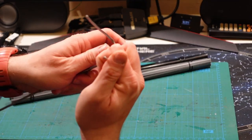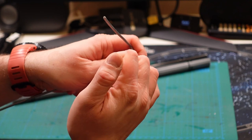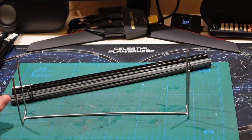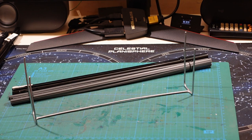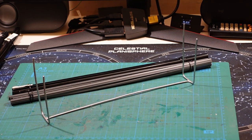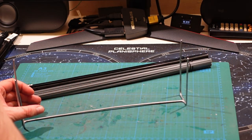You also need to grind the ends because when you cut them with a wire cutter they're going to be pretty stubby implements. Another thing: cutting is an asymmetric operation - it's extremely easy to cut stuff but impossible to uncut it. So my wisdom is do not cut unless you're absolutely sure you need to. If you don't need to cut, don't cut - you can always do it later, it's two seconds to snap it off. But if you've snapped it and made a mistake, you can't undo it.